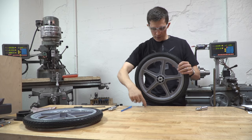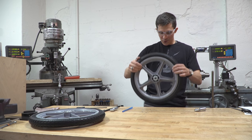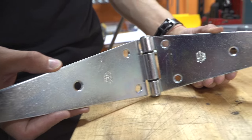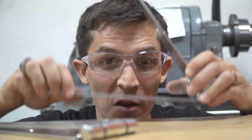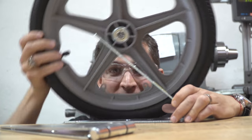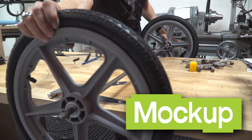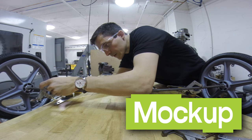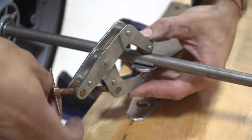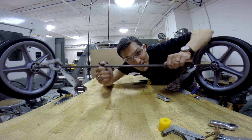I need to attach the wheel to the trailer in a way that allows the wheel to go bounce, bounce, bounce. My idea here is to repurpose some really big hinges. We attach the hinge to the box and the wheel to the hinge, and now we have suspension travel. I'm making a mock-up — a way of test fitting the parts by clamping them temporarily so I can see how they work together. That is a nice simple suspension system.